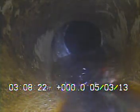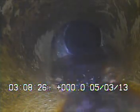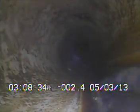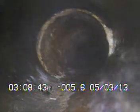Again, we are at the curb. For some reason it looks like the city reduced down to a four-inch line. This appears to be a newer six-inch PVC, now coming back into six-inch clay.